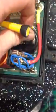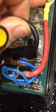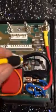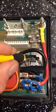The issue we had is that the pod lights weren't working. It can be a number of faults, but generally it can be the R1 — resistor 1 — just down there. The most common fault for that particular thing is normally the IC1, just there.